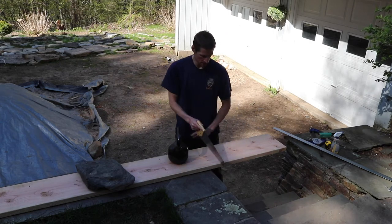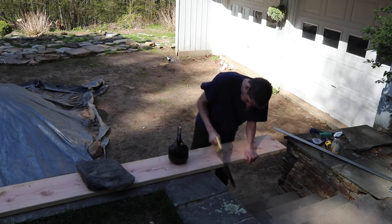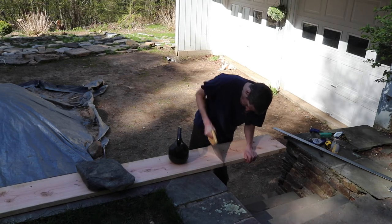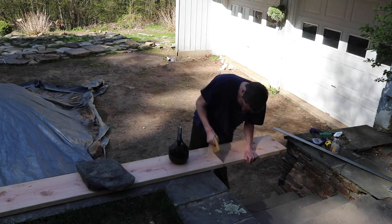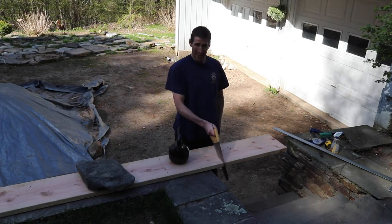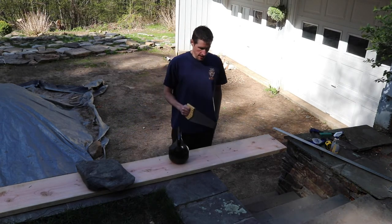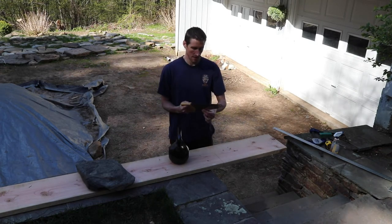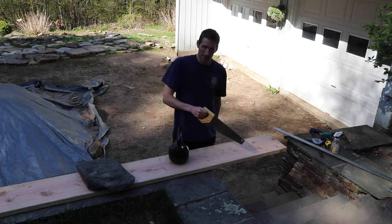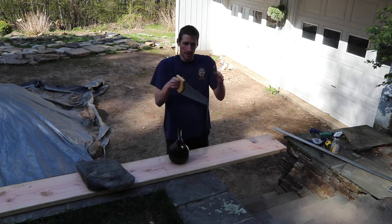Let's get to about halfway. I made it about halfway with my dominant hand. This is Douglas fir — it's still a little wet and the sap might cause some binding of your saw. As you go through, as you get towards the middle — especially towards the end — you might find it's getting harder and harder. Also because maybe your cut isn't perfectly straight and it's kind of binding against the saw.